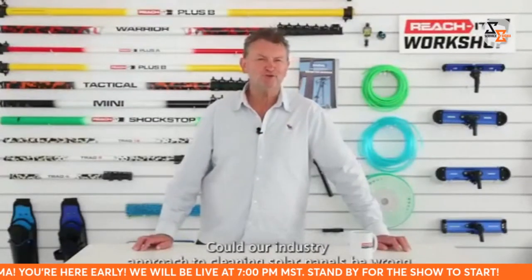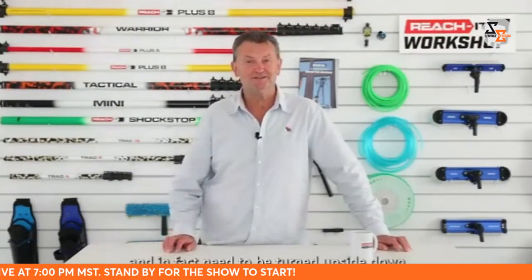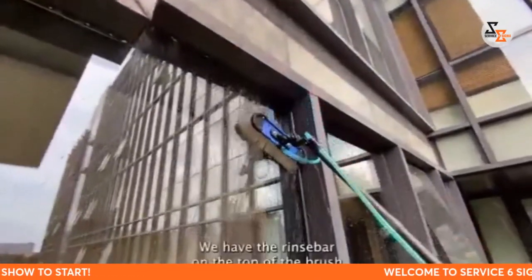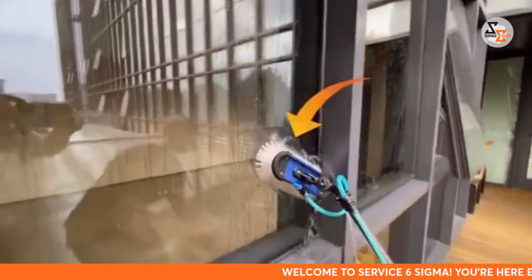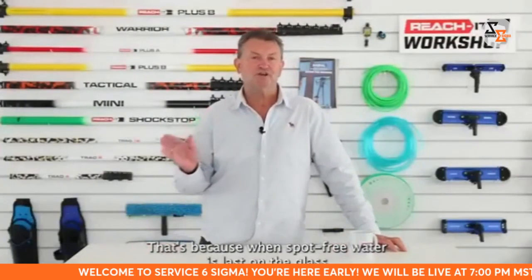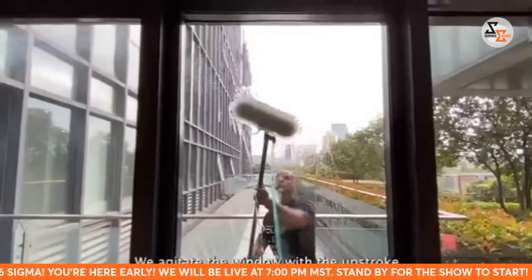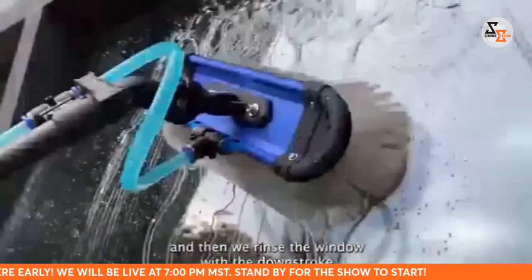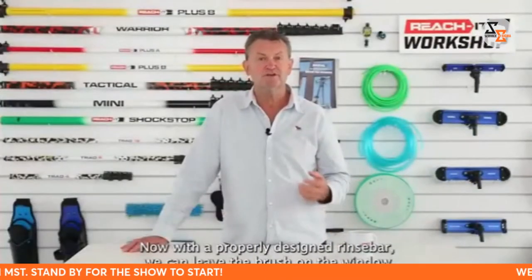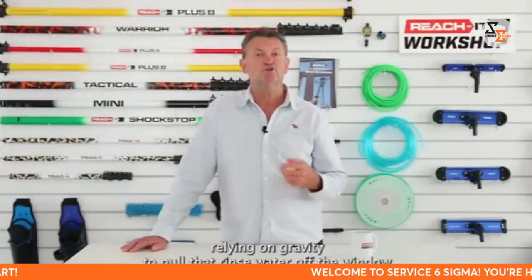Could our industry approach to cleaning solar panels be wrong and in fact need to be turned upside down? When we clean windows with a water-fed brush, we have the rinse bar on the top of the brush. That's because when spot-free water is last on the glass, then the windows will dry spot-free. We agitate the window with the upstroke, and then we rinse the window with the downstroke. Now, with a properly designed rinse bar, we can leave the brush on the window, relying on gravity to pull that rinse water off the window.